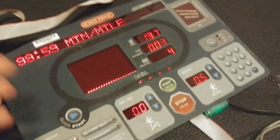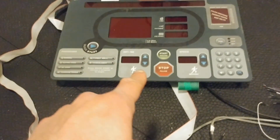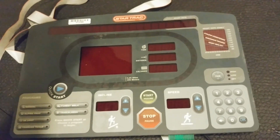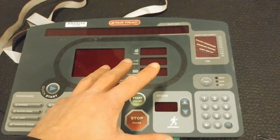The next step is to take a look at the board and the different things on it. Now, I've already unscrewed this one before and taken a look at the underside here, but let me insert a little image and tell you what I want to talk about. If you look at the board closely, you can tell what on the back of this PCB is the ground, because just by convention, a square solder pad is used for ground. So let me see if I can take a photo of that I've already taken and insert that in the video right here.